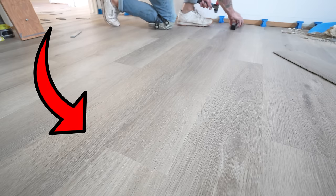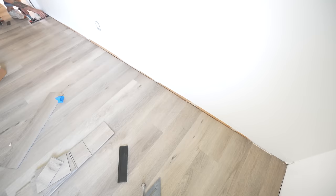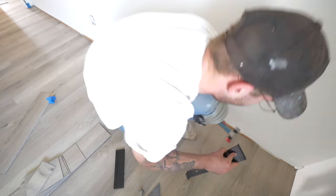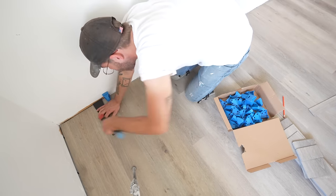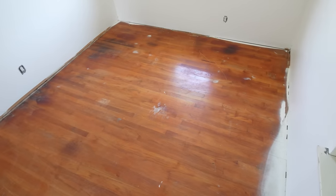I've still got a little quality control to do before I remove all my spacers. I'm going to make sure there are no gaps on the ends of any of my boards, and if there are I'll use my pull tool to hit them into place. Running down your entire wall with the pull bar is not a bad idea — you'll find that spacers get really locked in on the other wall after doing this, but the pull bar can help get them out.